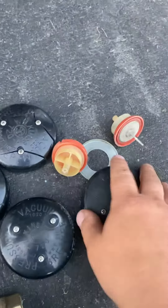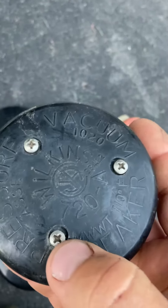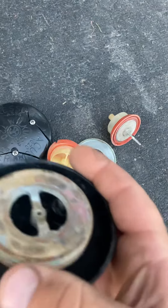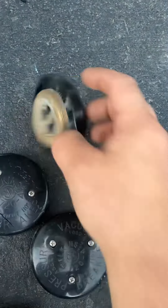One thing I've seen a lot of lately: 720A's in northern climates. You can see this one is off-centered. There is a crack there. But they're dished out, and especially if it's cracked, you want to take that off before firing the water up.